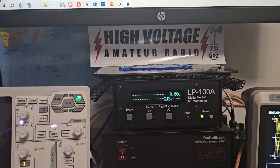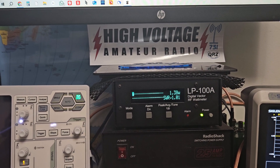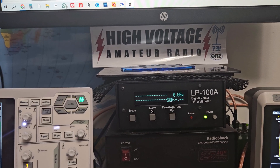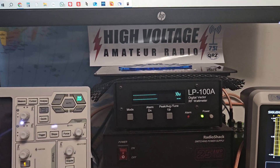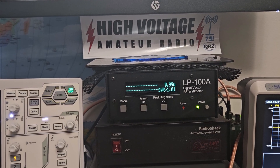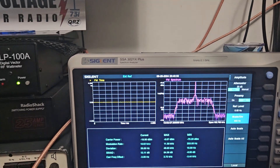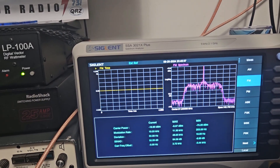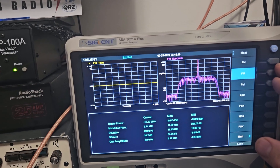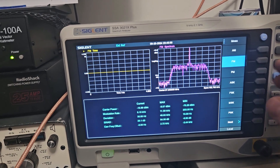I haven't been on the radio at all today so I don't know what's going on out there. I'll put this one on the air when I'm done. Maybe go up on 10 meters again and try to do another radio contact with a 2:1 SWR — you can do it, that's the thing. When I get my Moseley antenna up it'll be different. I'll have an intended design for those frequencies and it'll be much more enjoyable with a directional antenna that resonates. I can go on 12 meters with this radio, and hook something else up for 15, 17, and 20 meters. I think I'll do quite well with some DX on 20 meters — my tower is about 20 meters tall, so a 20-meter Yagi at 20 meters should do well.